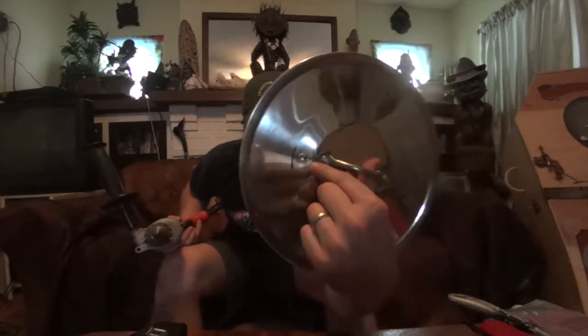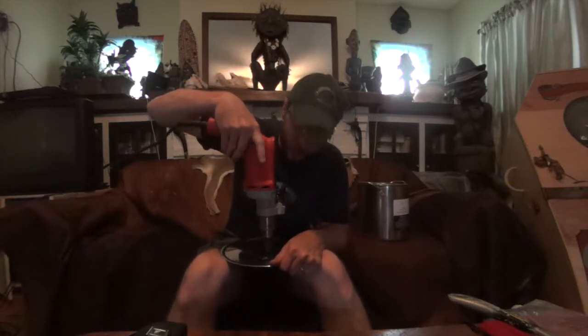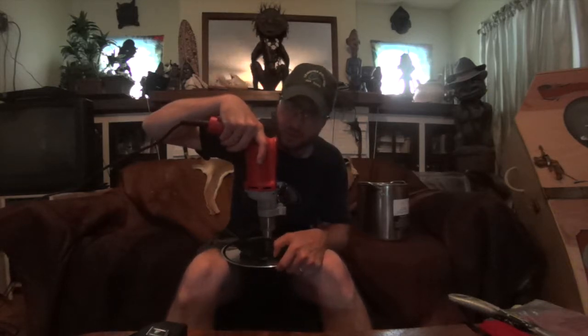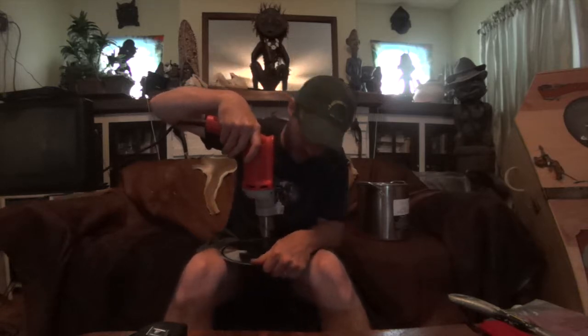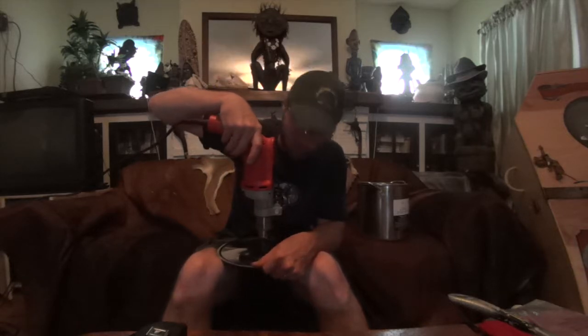Okay, whenever you're drilling metal, to get started, a little dimple. I'm not trying to bend the metal, which is why you see me not pushing super hard. If I wanted to get through that real fast, I'd put 2 hands on here and just punch it. It'd go right through. I'm trying to do a controlled speed hold, and I'm varying the speed so that once it starts to go through, you're going to notice that it's going through by seeing those shavings appear. Once those shavings appear, just continue to press. Regulate the pressure though, because once it bites and starts going through, you're going to get your hole pretty quick. Now I don't want to go past my outer line, because that's my cut line when I go in a circle here.